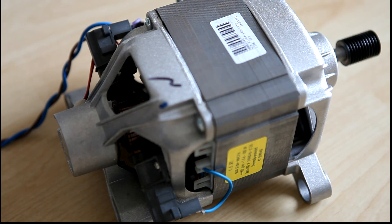These are sometimes used in industrial equipment because they provide very good starting torque. The current surge during switch-on goes through the field windings producing very good starting torque, but as the motor picks up speed the current reduces, which means the current through the field windings reduces and so the speed of the motor increases further — and the whole thing just keeps increasing. If you're not careful the motor blows up through over-speed because these are not self-regulating.